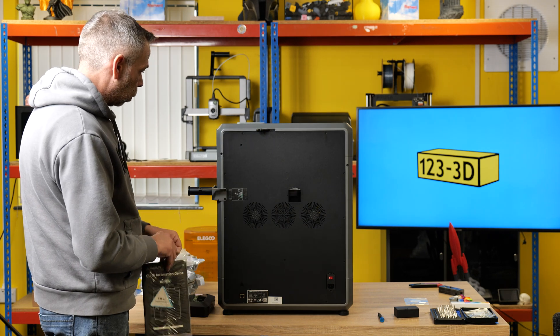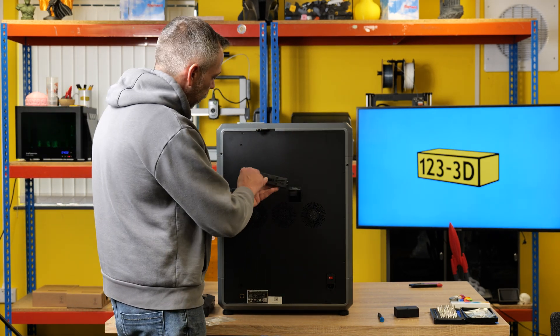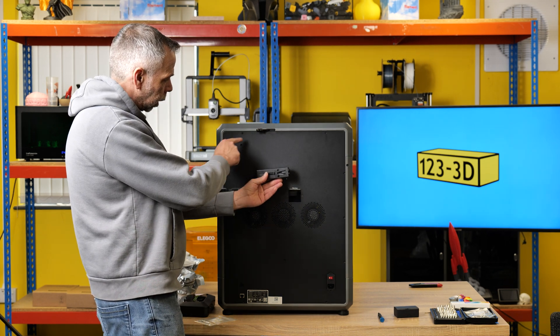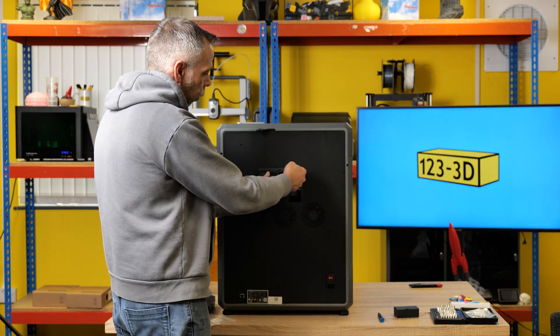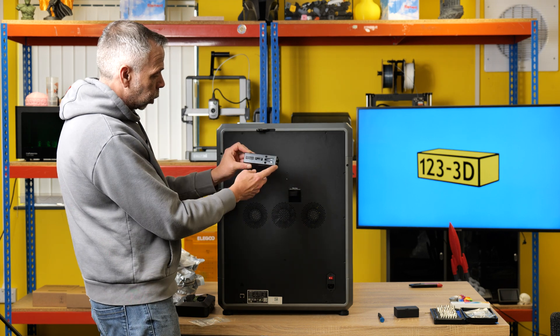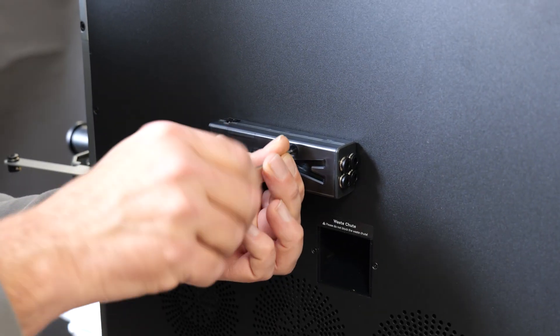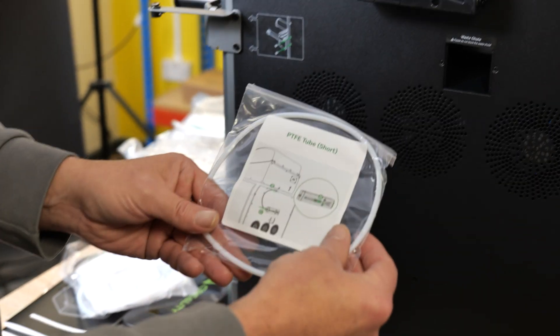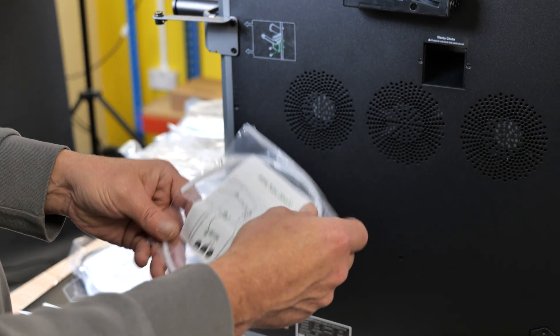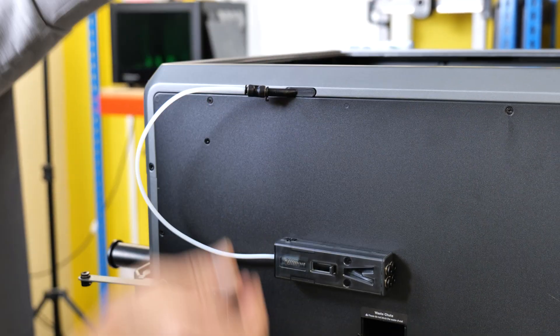Buffer - I will consult the manual because it doesn't give me a direction. We have a single hole here, so basically the tube will come from here into there. The CFS can then plug into that side. Creality logo facing up the right way - we should be golden. Just nip these down, don't go mad, this is plastic. Short tube - we'll have this first. So the short tube goes in there and in there.